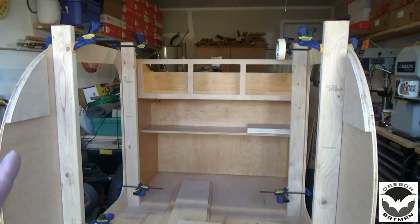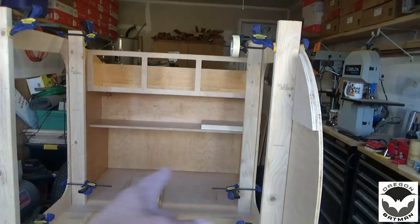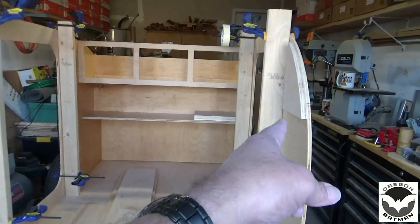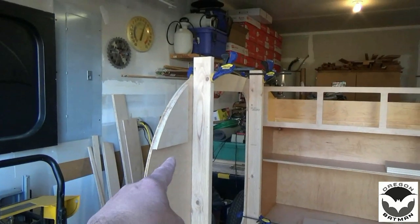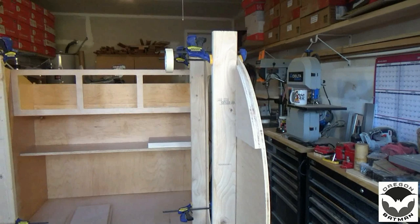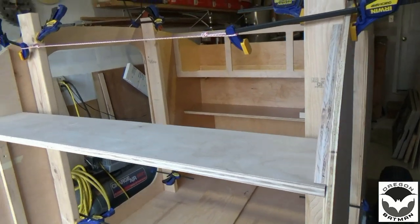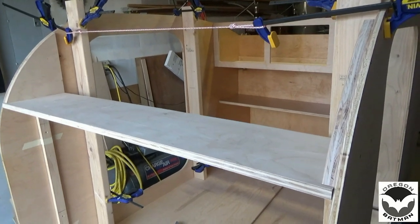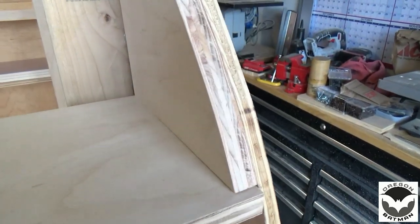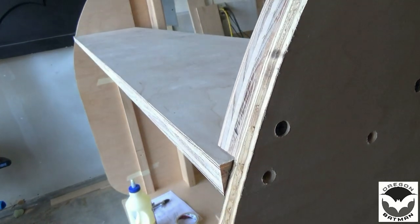We have both sides on now. Next is to take our piece of three-quarter inch and cut it to width - the inside dimension is 46 and a half inches. We're going to go ahead and get that width cut, then get it clamped in place. We'll drill some holes on each side because we're going to fasten from the outside, and get some glue on it also. I've got my makeshift shelf in there with my little clamp - flush with the edge on the front and comes right to the back corner. Then I scribe the line so we can get an angle and get that cut. I'll do that to both sides.